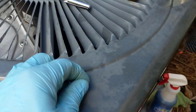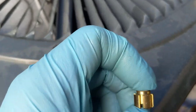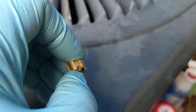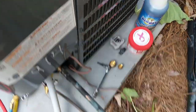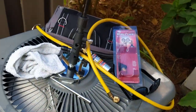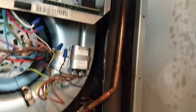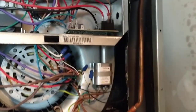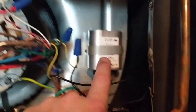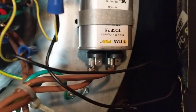Going to go inside and put the 057 piston inside — that's for the 2-ton unit. Button up the inside. Then we'll come out here and unhook the outdoor condenser, get this old one out of here, and get ready for the new one. We've got the line all insulated, got the correct piston put in. Now I'm getting ready to throw the cover on. Also went ahead and changed the cap — since we're here doing all this work, might as well put a new cap in there.